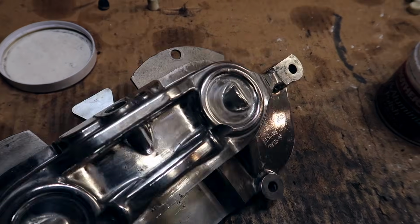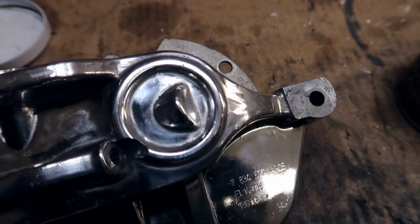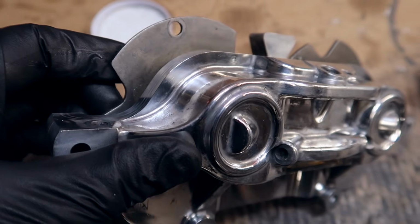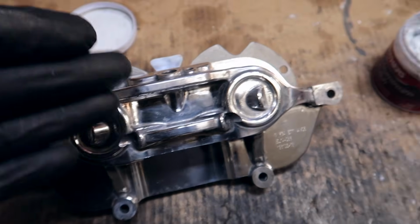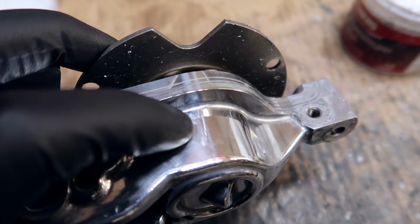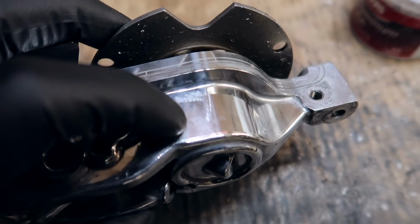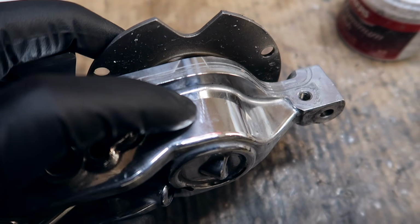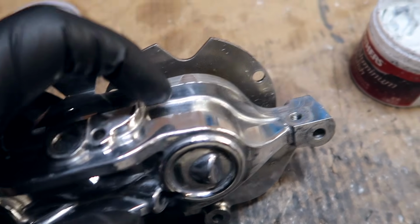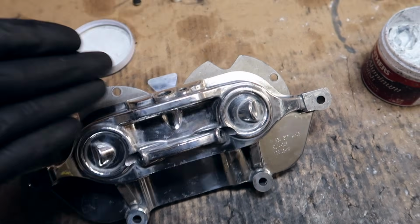So after you use the very small and thin bit, you can tell that all those edges are much cleaner. All those edges are way, way cleaner. But this is another reason why I like to use the thin one before we get to the medium bit, right? Because you tend to burn the spots around the area that you're buffing or polishing, so it creates these scratch marks. It's hard to tell, but those little scratch marks right there, I would rather get all the edges out and then use the small medium bit and get these scratches out as a final buff and polish.